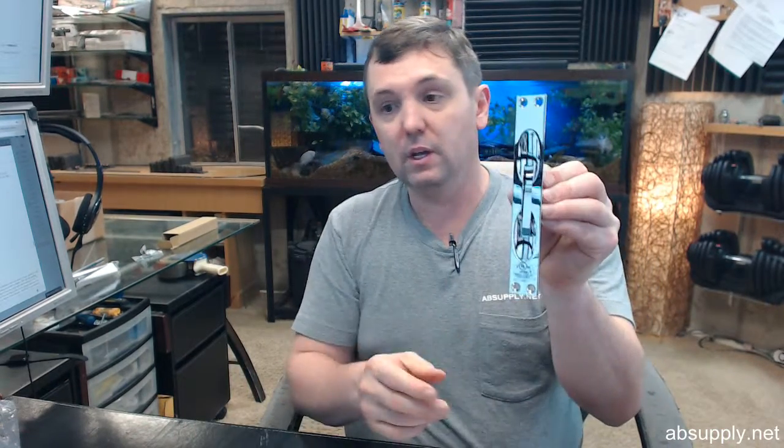Replacements are very common. There is also a link below this video to a document called brochure that will show you, it's a subsection catalog that will show you all of their bolts, not only the steel door model, but the common 790F, which is the corner style, far more common for wood doors, because that is something that could be mortised on an existing wood door without too much trouble. I mean, a router would be the way to proceed with doing that, but it could be done otherwise as well. But adding an extension style like the 780F, that would be a challenge again. So the template is the important part to review to make sure that if you're replacing one, this matches up.